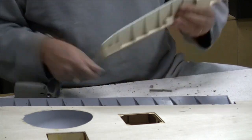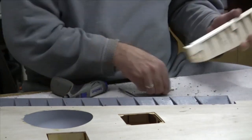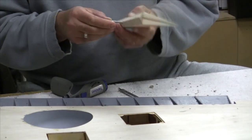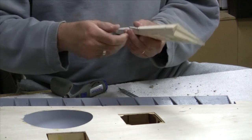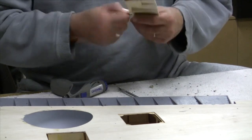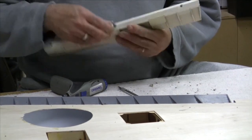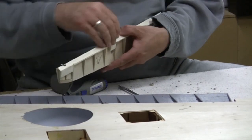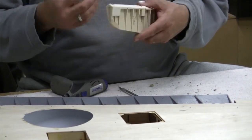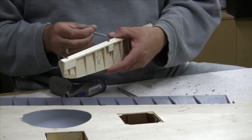And man, that was a lot easier than using that drill bit. I'm gonna tell you, that was almost perfect. That hinge now, look how tight that hinge is. I can put that hinge back in with epoxy. I don't have to re-drill. I don't have to put a dowel. And the dowel would be good. If this hinge were to break off to the side, a good way of replacing this is putting that dowel like we did previously, like I showed you.